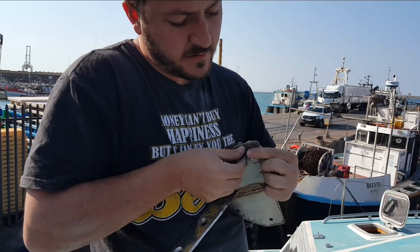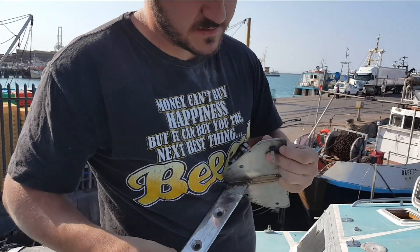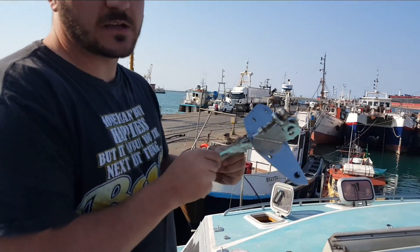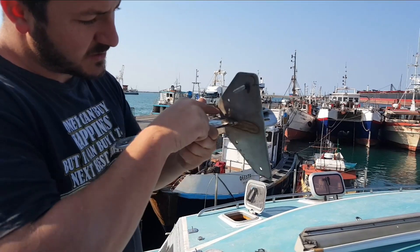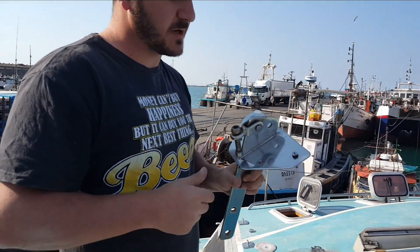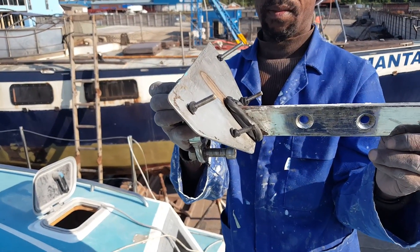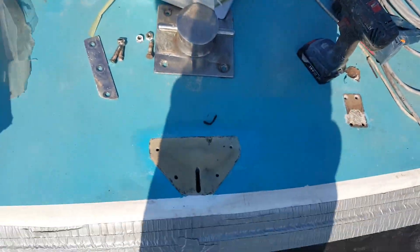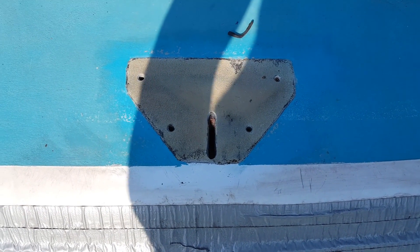A second wrap around the screw — doesn't have to be a lot. Whatever's excess will just push out the side and we'll flatten it up. This also gives us the opportunity to take out the chain plates and inspect them — you want to check for any surface cracking, which would be a very thin crack. Everything looks good on this one, the surface on top is nice and clean. We've done that around all four screws on both sides and on the base, making sure that cavity is nicely filled up once you press and tighten everything down.